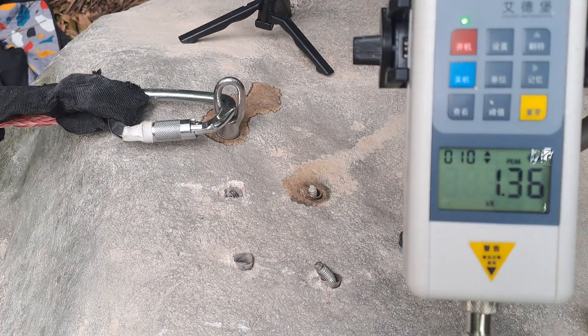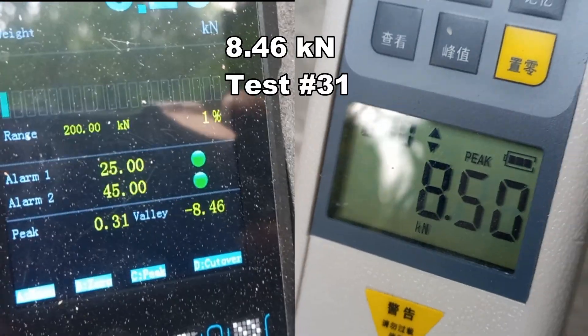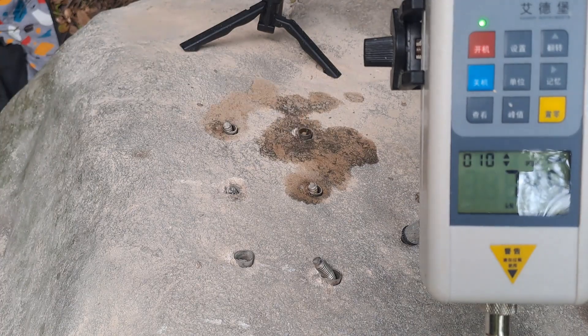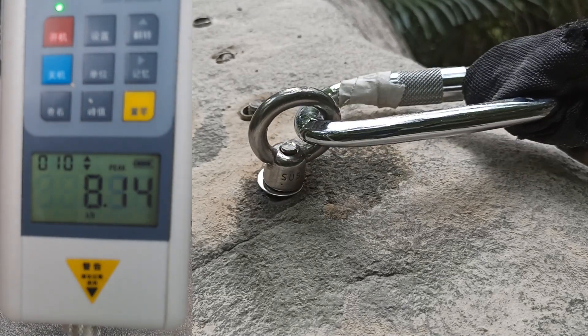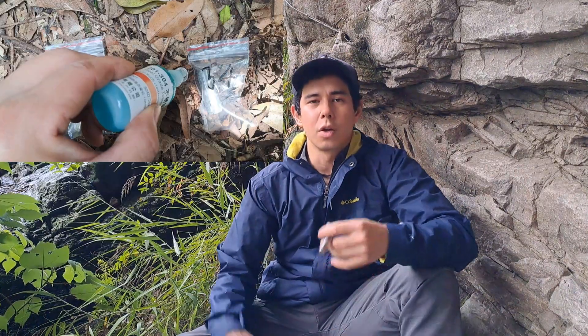We tested two more. Almost 9 kN in one test. I noticed the carabiner slipping in the ring nut partway through the test, so we switched it out for a new one — that one came in at 15.82 kN. I was curious if the metal grade had anything to do with it, so we did a stainless steel detection test to compare the bolts that broke low to the ones that broke high.